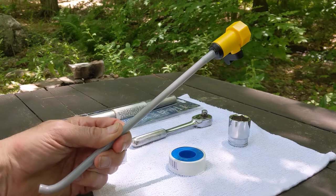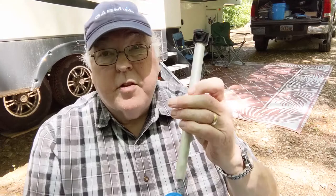We also have a little spigot device — a flushing wand — that we use to clean out the inside of the tank once we pull the old anode rod out. We'll use this to get deep inside the tank to flush it. This is Teflon tape used for sealing plumbing fittings. One thing to be careful about with Teflon tape is that you can over-tighten your fixture, because there's not a lot of friction and you can apply a lot of force.